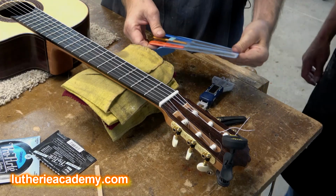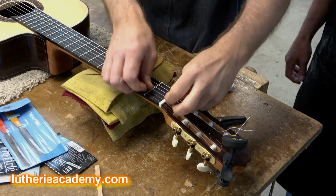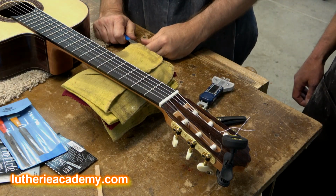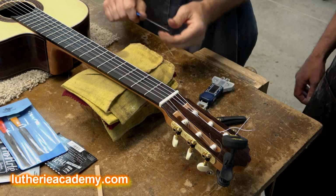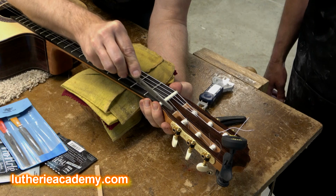So we need a 24 thousandths, and we've got a 26 thousandths file. And I do this all under tension. I just pull that sucker out of there like that. Wow. Now, we are not going down very much. We're sitting at about 9.5 or so. So I'm going to come in like so and just deepen that slot ever so slightly.